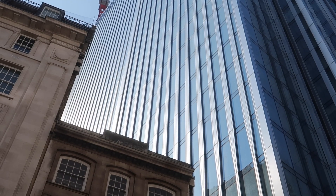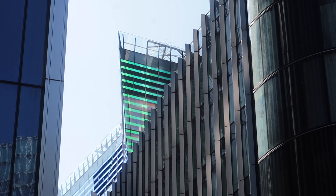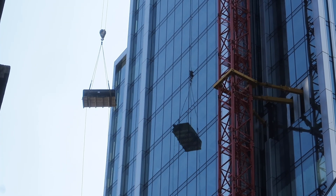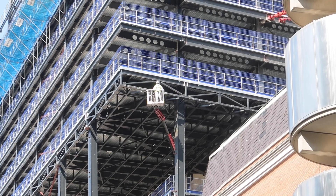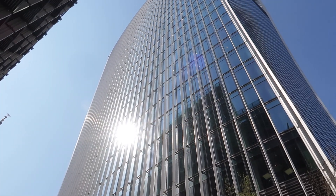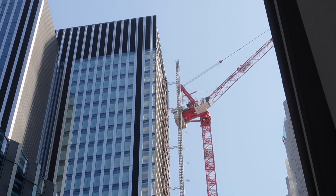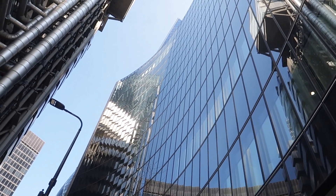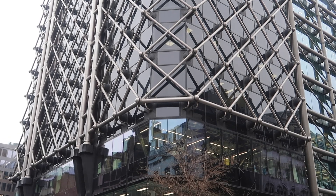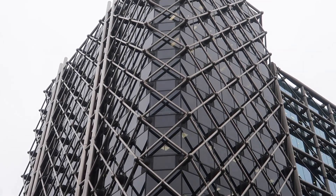But there's one fundamental risk of having your structure exposed, and that is fire. All building designs need to give protection to occupants if there's a fire — choosing the right materials, having suitable fire exits, etc. But the fundamental thing you must have is for the building not to collapse too quickly before everyone is evacuated. This is called structural fire resistance, and fire ratings here in the UK differ depending on type, height and use of a building. For a building like this over 30 metres high, it will usually be two hours.